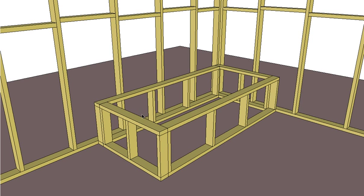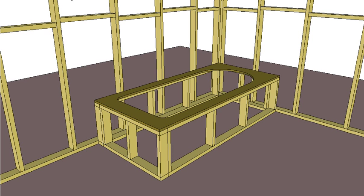The bath sits in the top of this frame. Because the bath is round or has rounded edges generally, the other thing we need to do — what they traditionally do nowadays — is get a sheet of structural flooring or a large sheet of ply, cut the shape of the bath out around there, and also allow some packing so that you can get your filler board, whatever lining you use, and the tile and tile glue to fit under the lip of the bath.